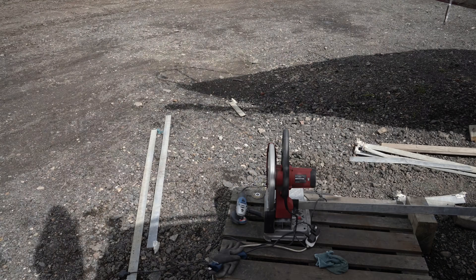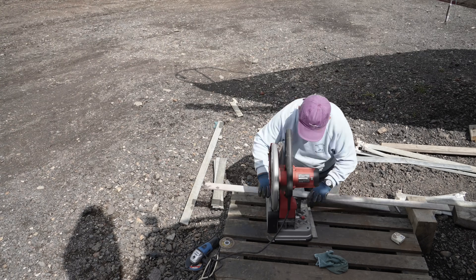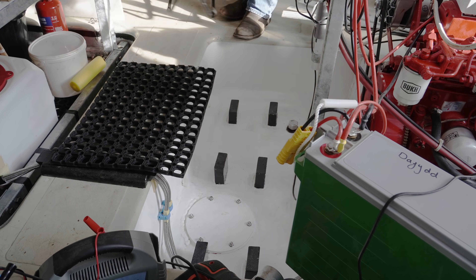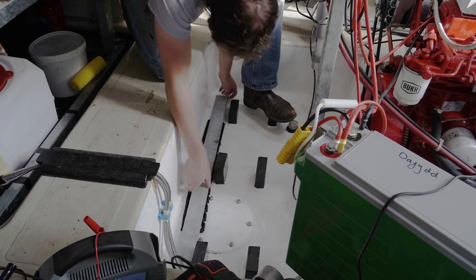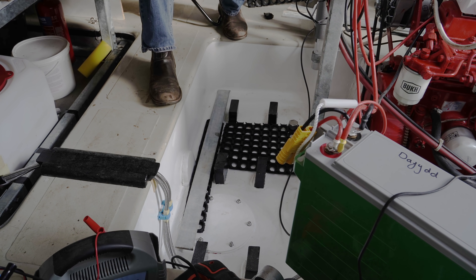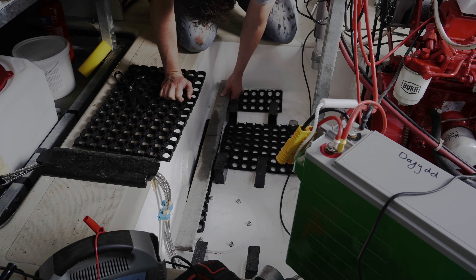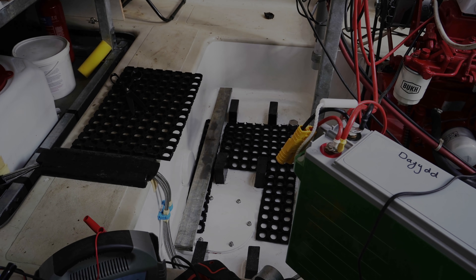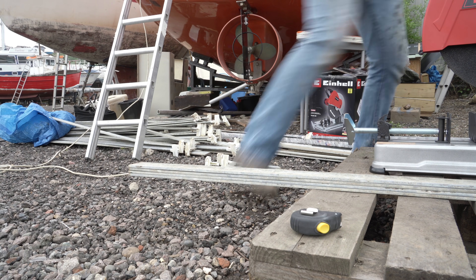Although I want to make the bundles as neat as possible, we're not agonising over millimetre-perfect lengths or deburring to the extremes. I wanted to prepare the inside hull and bilge areas earmarked to store ballast. I don't want to damage the carefully painted bilges, have any rattling, or see the inevitable vibrations from Alan's engine allow the ballast to carve its way into things. It'll be bolted down as a last step, but I've also decided to bed the steel onto a robust rubber matting. The bundles wouldn't enjoy sitting in puddles of bilge water, so it's raised and with plenty of holes in, and I'm designing in some gaps through which sponges can be inserted if I want to dry the whole area out.